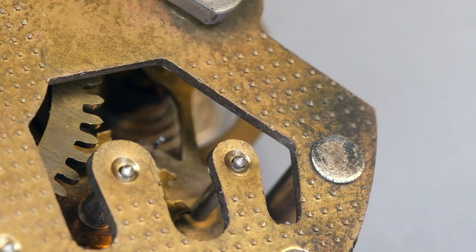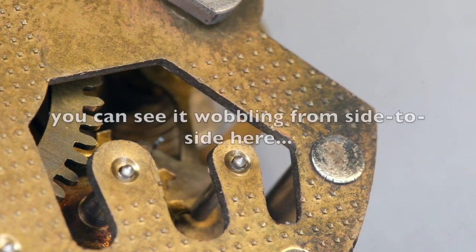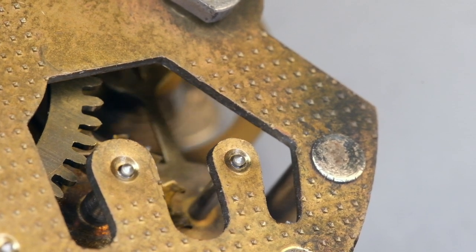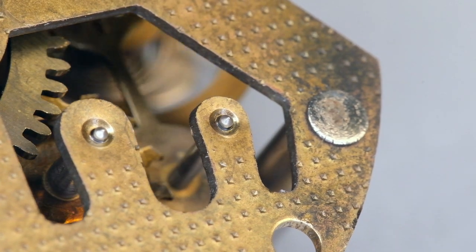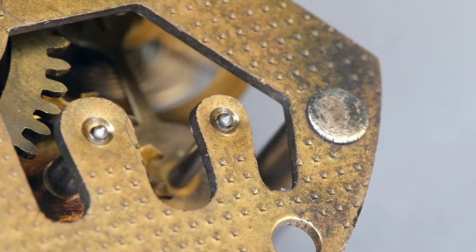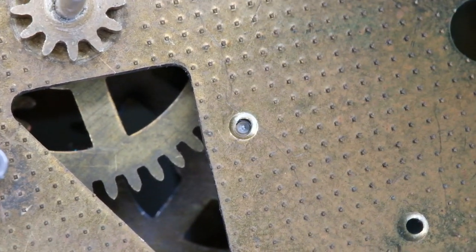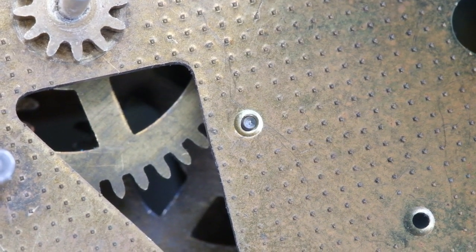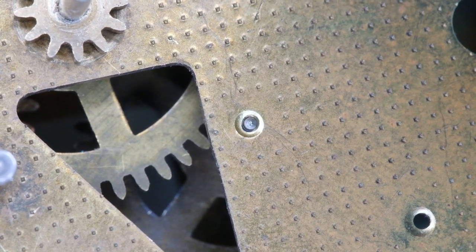When I first reassembled the clock, you may have seen it too, but I noticed that the pallet arbor bearing was worn. Well done if you saw that. And in the case of this souvenir clock, although it's obviously been used, the chances are it maybe won't be used that much, who knows, and it's actually running quite healthily as it is. But it kind of played on my mind, so I decided I would do what we call a bushing exercise, really as an exercise and a demonstration for this video, but to fit a couple of new bearings to reduce that wear